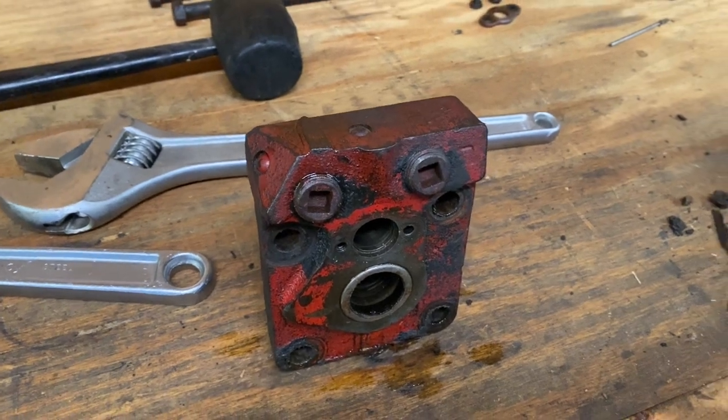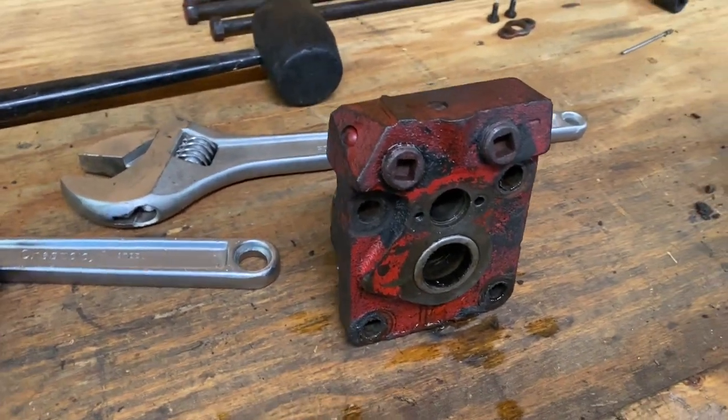What I'm going to do is take this small plunger assembly and this end cap to the hydraulic shop, along with the end cap from the other cylinder we looked at previously. I'll have the guy there look at them, get the rebuild kit for this cylinder. I'm not sure if I'll pull the piston out — I didn't have any issues with that. Glancing inside the cylinder, everything looks clean with no scratches or issues. I'll probably get a rebuild kit and pull the other end too, since I have it off — replace the o-rings on the end caps and get that little plunger assembly rebuilt so it quits leaking. I'll also get his opinion on the other cylinder's end cap with the crack — see if that can be brazed or just needs replaced.